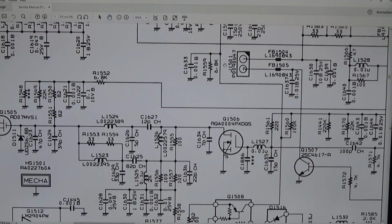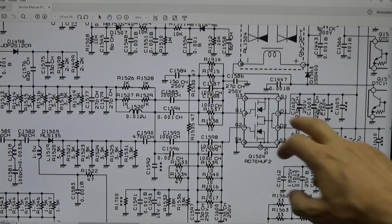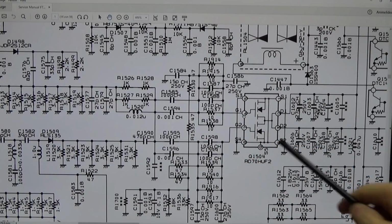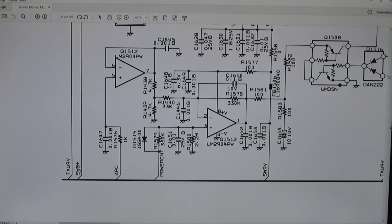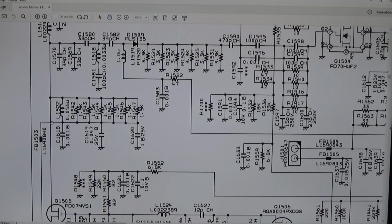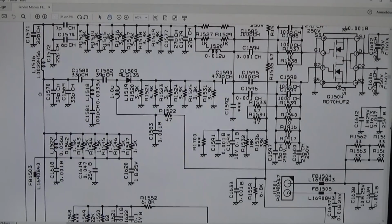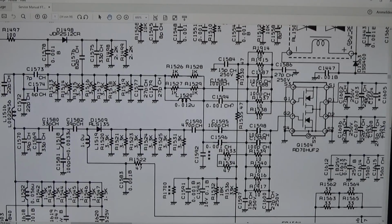However, it is cold, and yeah, I'm really wondering why we do not read bias here at gate 1. So something must be wrong. I need to check where our switched voltage is, which is finally delivering, as far as I can see, the bias controlled by our APC. And yeah, let me see where we are finally losing our bias for this dual pack of MOSFET.